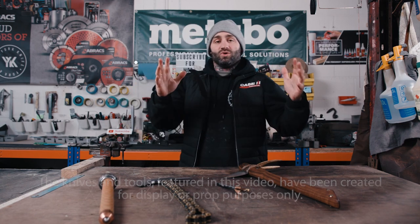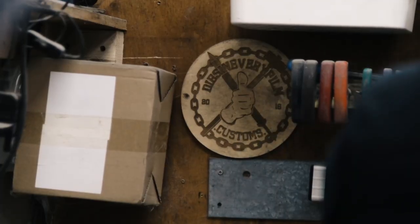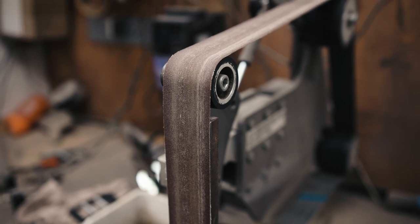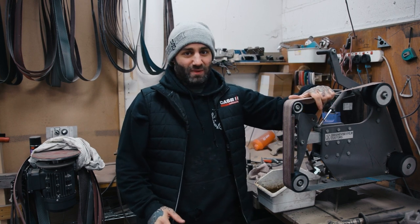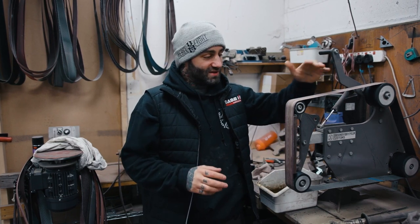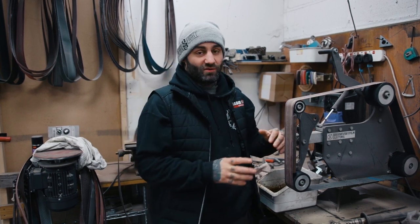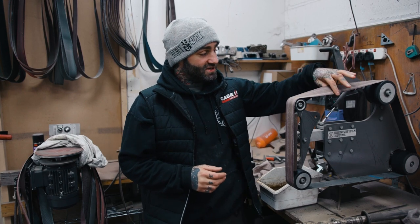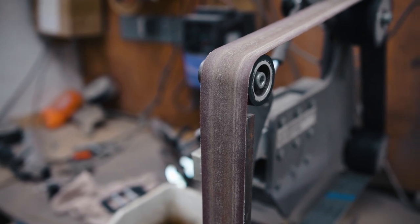Let's go and have a look at some of the tools I use in the workshop. This is my 2×72 grinder — I use this pretty much every single project. The 72-inch belt is perfect; if you've got a smaller belt, the abrasive wears out a lot quicker. With a longer belt it's not heating up certain spots at a time, which helps it cool a lot quicker, especially when grinding high carbon steel. Not only do I grind steel on here, I also grind wood. I'm using aluminium oxide for wood grinding, and then the Cubitron 2 for metal.